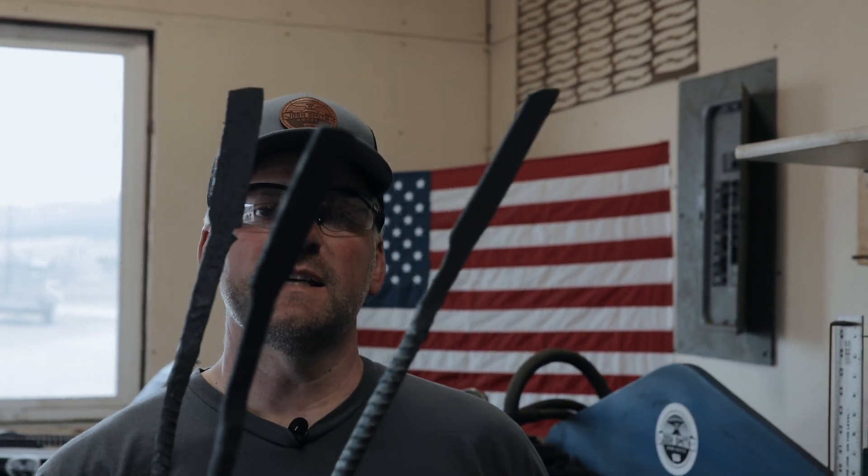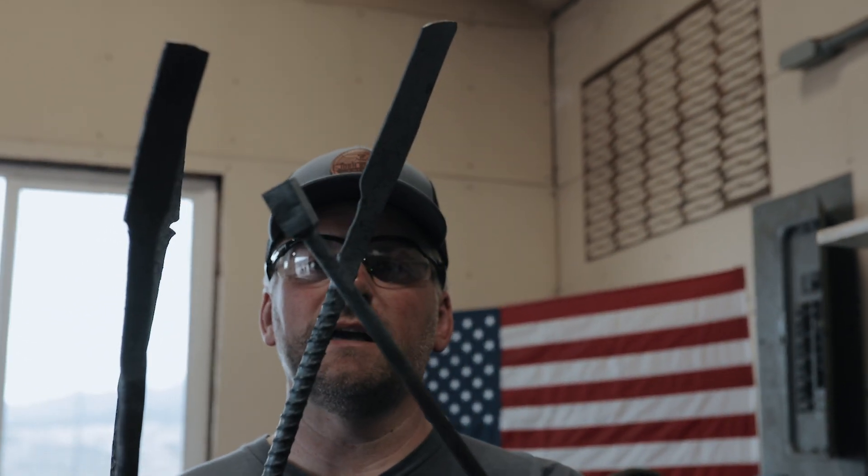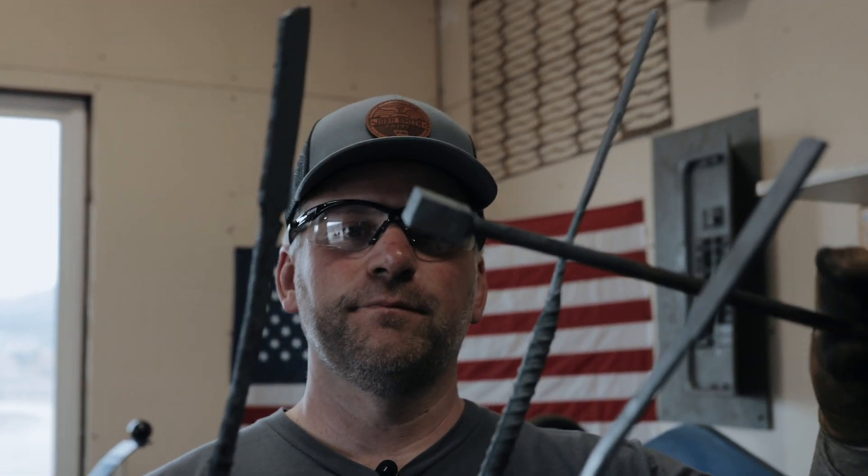So this is about 20 minutes of forging or less, and we got three folder-blade-sized pieces of steel out of a little block of steel like that. It's pretty incredible what a rolling mill will do, and wasting good Damascus steel is kind of crazy to do, so I try to conserve it where I can. We can take the same principle and just cut bigger slices off of a bigger block and roll them out to get fixed blade knives as well — they don't have to just be folders. That's an example of what you can do with just a piece of scrap.